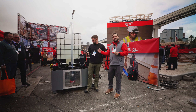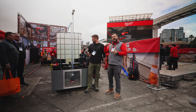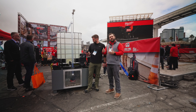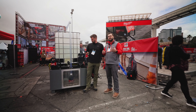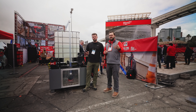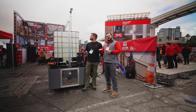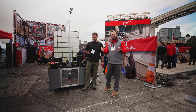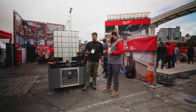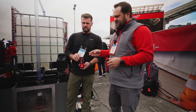This pump saves time and lasts longer with Auto Sense. It has electronics that can sense incoming flow, sense low water, and sense when water is back on to turn the pump on and off. On high we match the performance of existing one-horsepower two-inch pumps — about 90 gallons a minute flow rate or 60 feet head height. On low we tune that down to extend run times to over two hours, with over 5,000 gallons pumped.